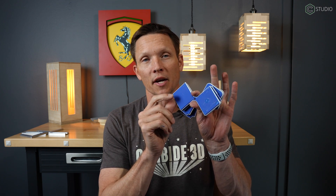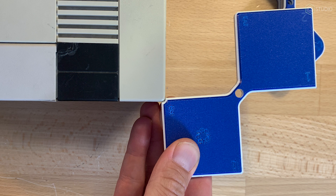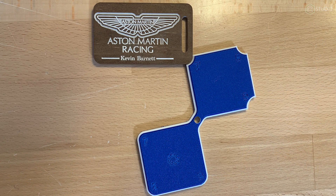Next I made some fillet gauges. What are fillet gauges? They measure either the inner or outer fillet on a pre-existing object. These are particularly useful when mimicking an object — if you're going to reskin something, or if you want to match a piece that's going on top of another piece and you want to match the exact fillet. I initially made some out of aluminum, then went back and made some out of HDPE. These may not last too long, but they're friendly and fun to use. You can make them out of almost anything — any shape you want. Again, that's the point.